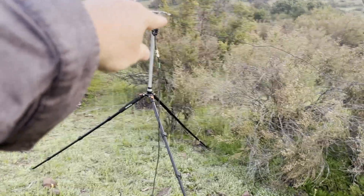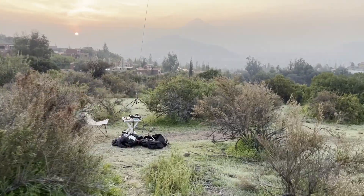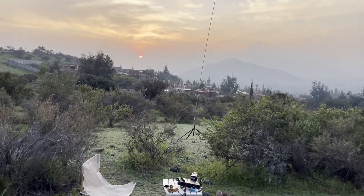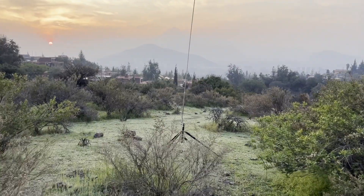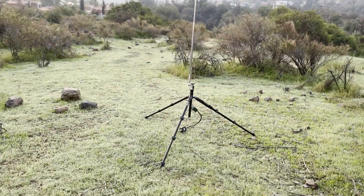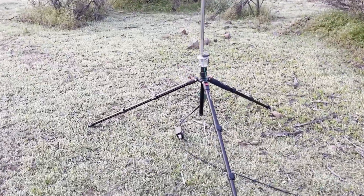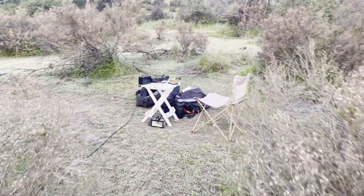The Performer goes into a line choke, then the coax into the antenna switch. On the other side, I've got the Challenger, a half-wave off-center-fed vertical also designed by Greg KJ6ER. The whip goes into a 4-to-1 un-un, then a line choke with a little counterpoise — four or five feet long depending on the band — then back into the switch.